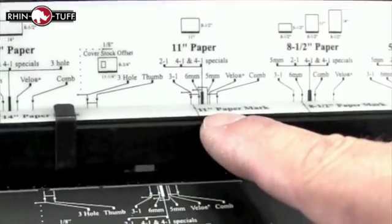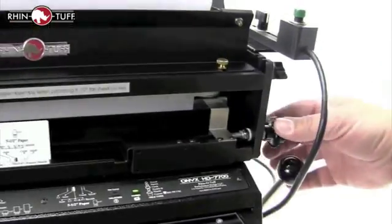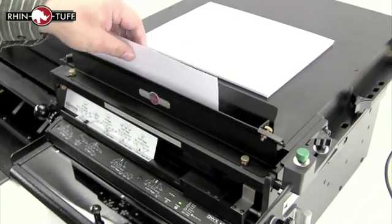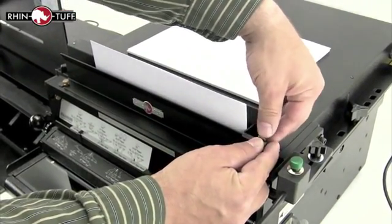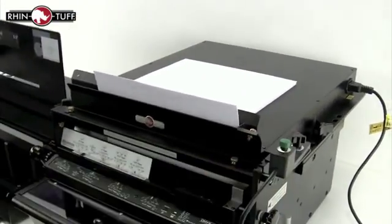With this book, we'll be using a 3-to-1 pitch coil punch die. Keeping an eye on the paper guides in the front, you want to align the size paper with this type of die that you're using. This dial knob on the right side allows you to fine-tune to get those lines exactly perfect. Drop your paper now in between the 2 paper guides into the throat of the machine, slide it to the right until it stops, and adjust this final stop. And we're ready.